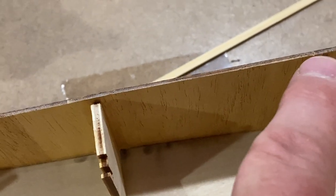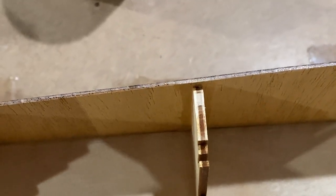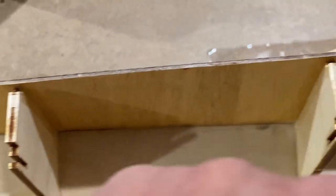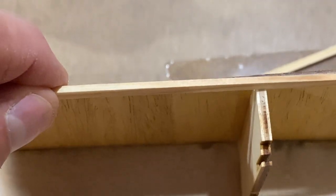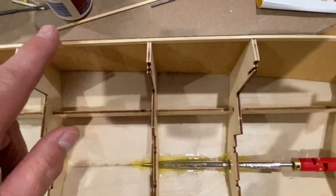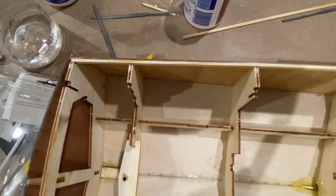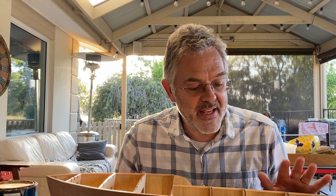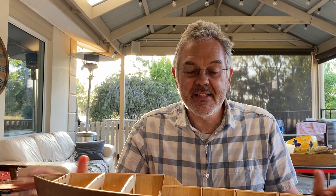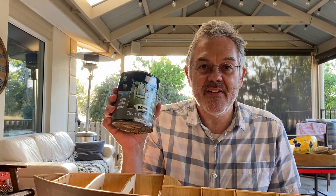These little gaps were the notches from the original frames that the sides of the boat fitted into — when you glued it, it left this little gap, and that's what these stringers are now going to fill. They're going on really nicely and provide more structural integrity to the side walls. Now I need to seal the inside of the boat, which is going to take three coats of clear varnish.